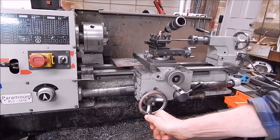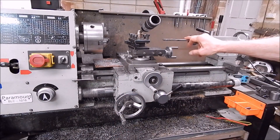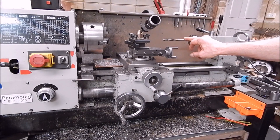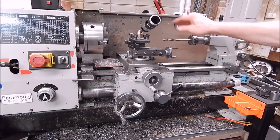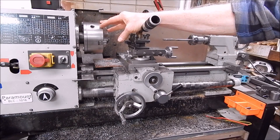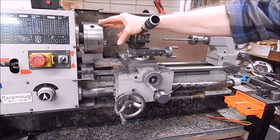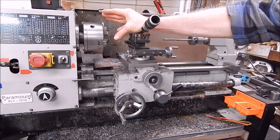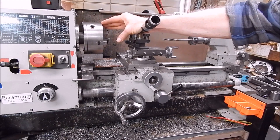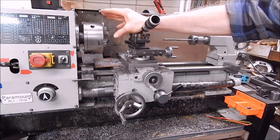This old girl's been doing a lot of work. Let's see if I've still got the reamer set up in there for reaming out for the piston and everything. Collets — I've had them up this end too but I've swapped it out. If you ever buy a lathe, think about swapping out the chucks, because if you want to use collets you're going to have to swap out the chuck and swap in the collet chuck, swap out the three-jaw, swap in the four-jaw.